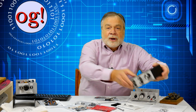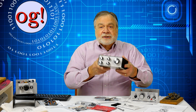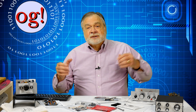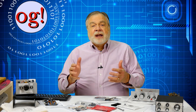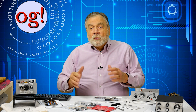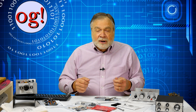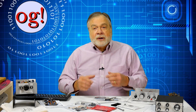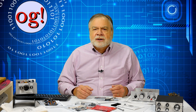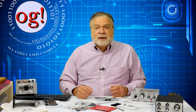Kits can be hard to troubleshoot. I had to send this OHR 100A 20-meter CW QRP rig back to the supplier with a plea to make it work. Sometimes no tech support is available at all. A single mistake can be hard to find, let alone multiple mistakes. And some once common parts, such as variable capacitors, are getting rare and expensive. If you lose a part, it can be hard to replace. For some reason, hand-winding toroid coils is taken to be the bane of kit building, but I've learned that the simple solution to that is patience.